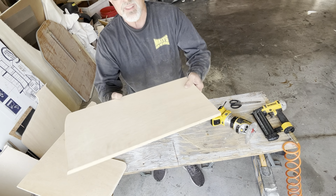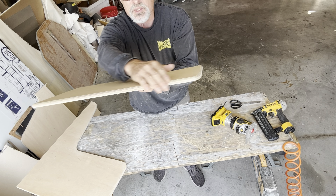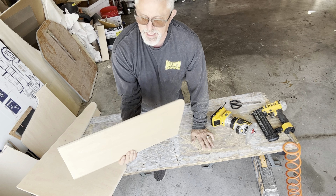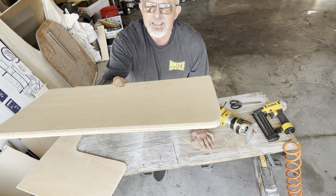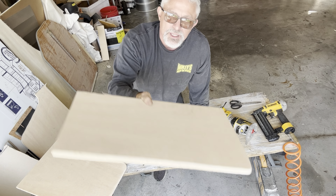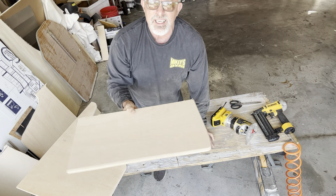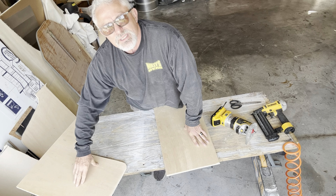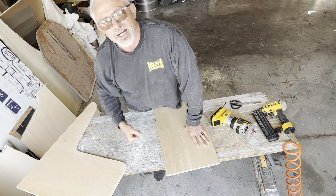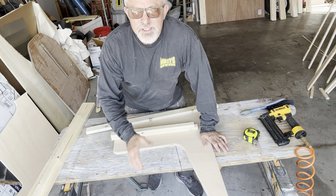Just as easy as that. Now that wasn't even the right side, but this gives us a real smooth area right there. I'm still going to sand it. If I was going to amber shellac I might, but we're painting this one — it's going to have some paint plus amber shellac. I'm going to sand it down with some 220 grit, and once I get through this step I'll start building it and show you a couple of key details you don't want to miss when building your dinette seating.